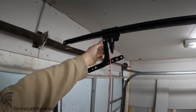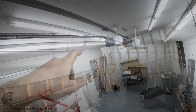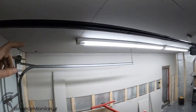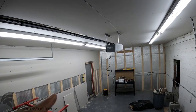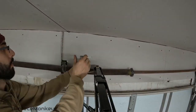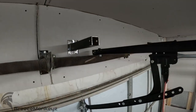We're going to do a dry run — leave the carriage disconnected, see how it closes and how far forward it goes, then pull the door manually all the way open and see how close it gets to the motor. I'll put a stop up front — might use the original tab, might just put a bolt. The stop in the back is normally a bolt too; we're not going to put it yet. We'll see how close it gets to the motor and see if we need to drill a new hole.